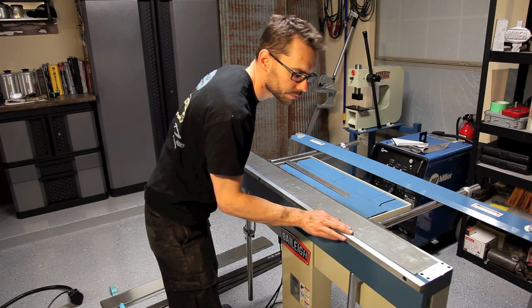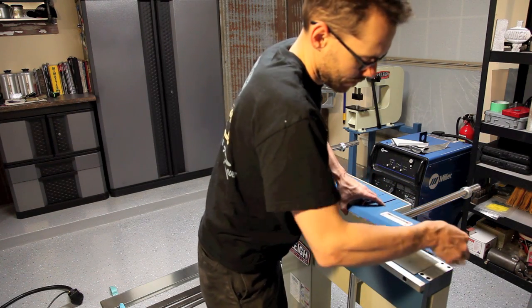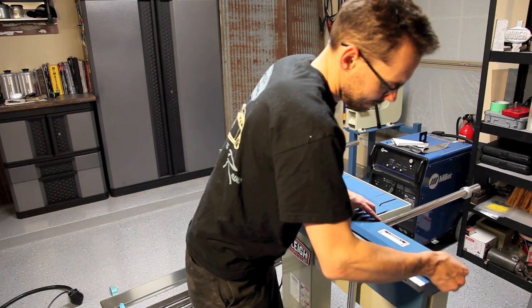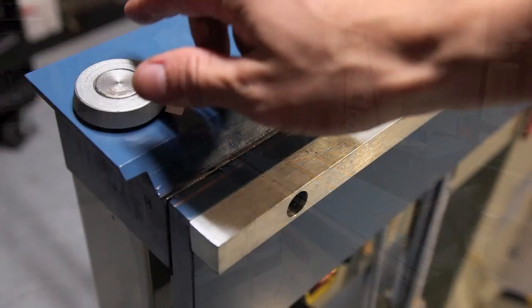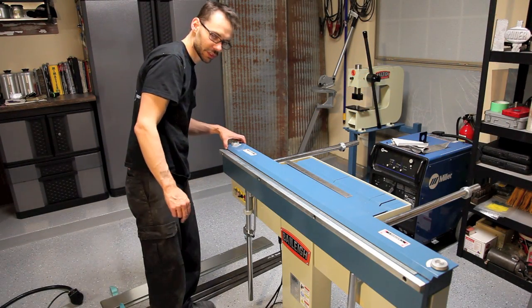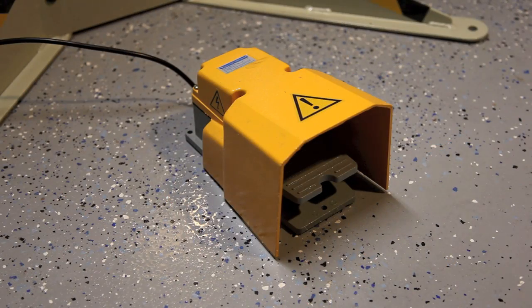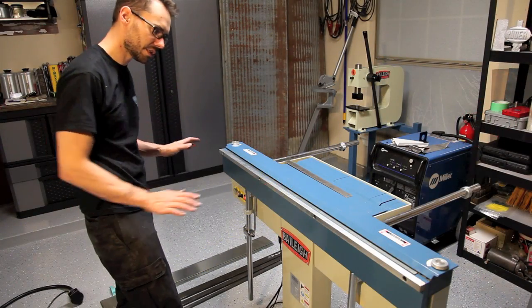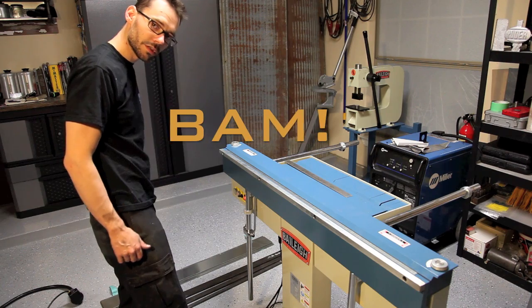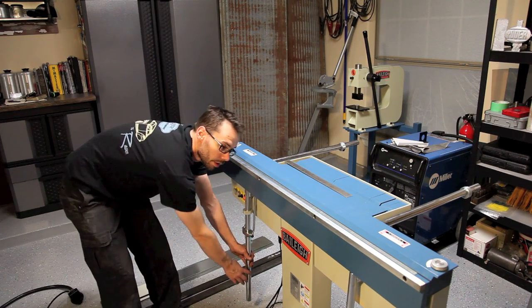So you line up your marks and then you grab this. It has dials on the ends for your offset. There's a little groove that this sets in right there, and you can dial in and fine-tune adjust where you want it to clamp down right under the line so you get a perfect bend every time. We're going to turn the machine on — this one runs on 220 volt. It's got a foot pedal to actuate the power. First we turn on the main switch, then to activate the electricity — don't get your fingers in there, it will pinch them — I'm going to hit the foot pedal. Bam! It clamps it down, and now when you start bending it, it will lock down even more. Hear that click?